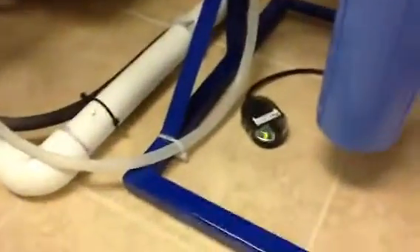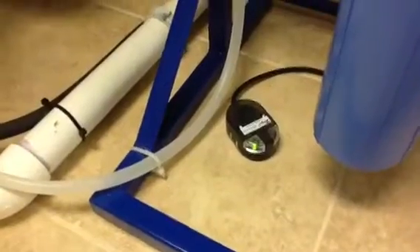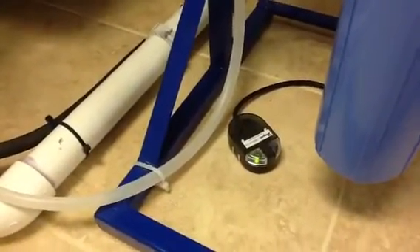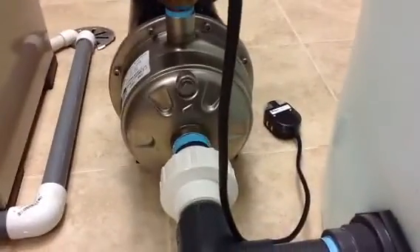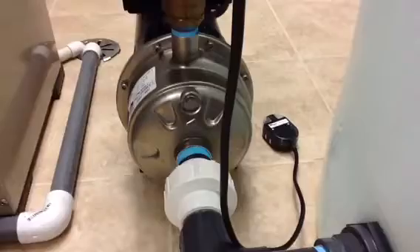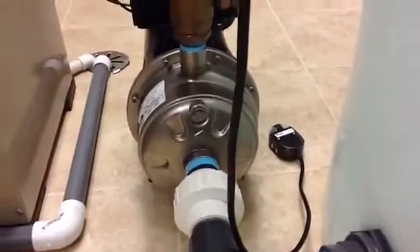The house cannot lose water pressure. We also have, for safety, two water bugs — floor moisture sensors — that will turn off the reverse osmosis and turn the city water back on. If there's a failure at the repressurization pump, we have a water bug on the floor as well that will turn the system off completely and open the city water valve back open again.